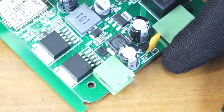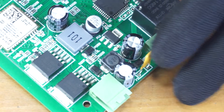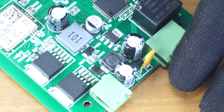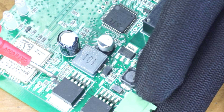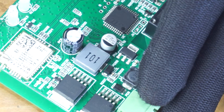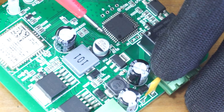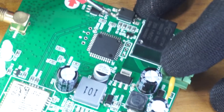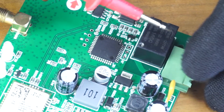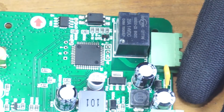Pin 30 is connected to the reset button. That is the reset pin of the microcontroller — once you press that button, you will reset the microcontroller program. Since it also turns off the regulator, you will also reset the GSM module. The 29th pin of this microcontroller is connected to the cathode of this optocoupler. It is the relay control pin. These are the pin connections of the microcontroller.